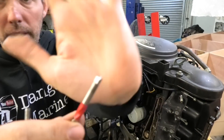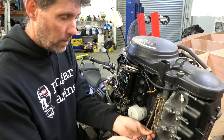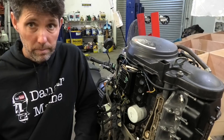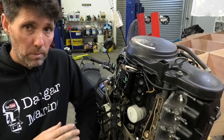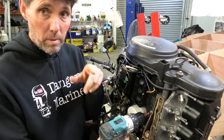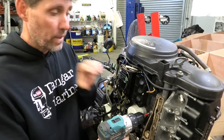The drill bit that comes with the kit has a square on the end so it can go into a T-piece. To be honest, this aluminium is so soft I could actually drill this out by hand with a T-piece, which is pretty easy. But I'm going to drill this one out with a normal cordless drill. You could put a little bit of cutting oil on the drill bit, but for such a small hole in very soft aluminium, leaving the chips dry actually makes it easier to blow them out afterwards. It also really helps if you have a friend who can check the angle to make sure you're going in square.